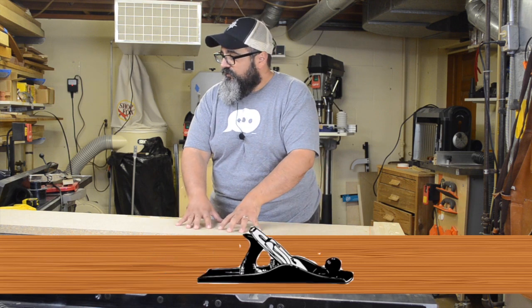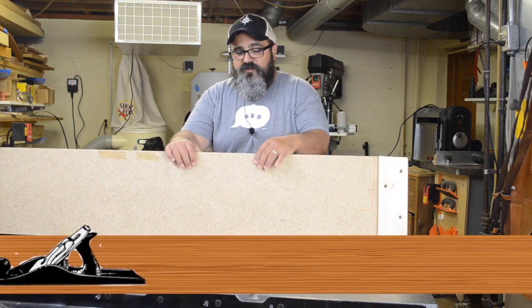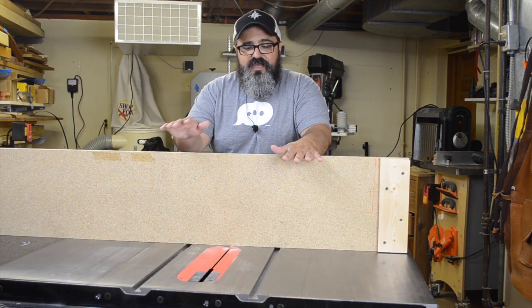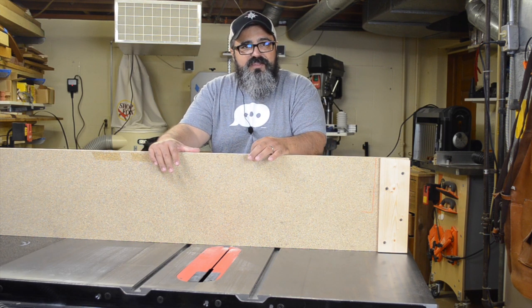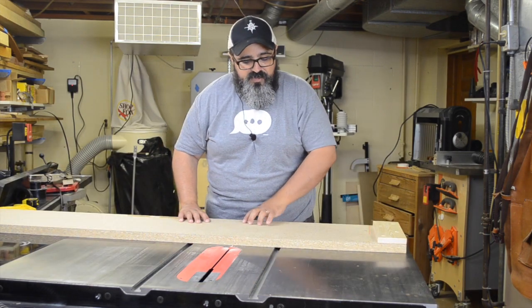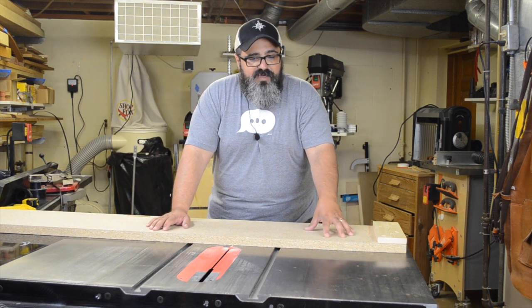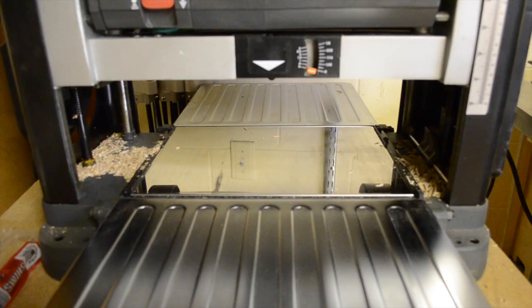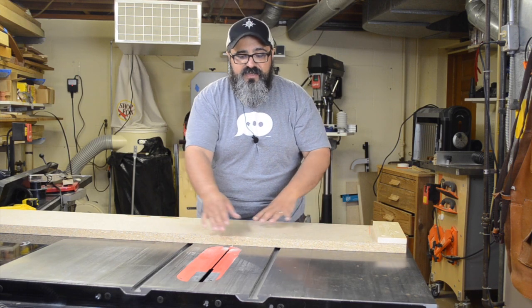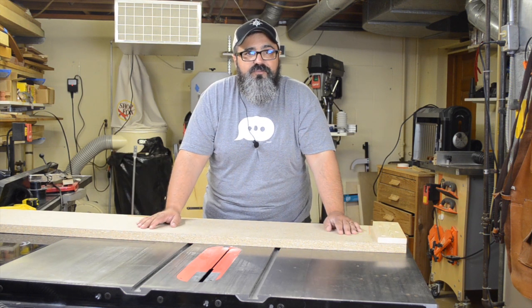So the first thing we want to get into is the materials that we use to make the sled. As we mentioned before, we just used some material right from the home center. This is what was referred to as an industrial shelf. It comes in at about 1 and 1/8 inch thick — it's just particle board or press board. It comes in at about 11 inches wide and this one's 6 feet long. The main thing you're going to run into with your thickness planer sled is how wide is the actual opening for your thickness planer. In some situations there are little guides off to the side, and obviously you want to make sure the sled is going to fit in between those, otherwise you simply won't be able to use it and it could get in the way of some of the mechanisms.